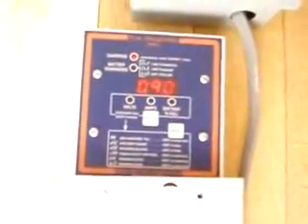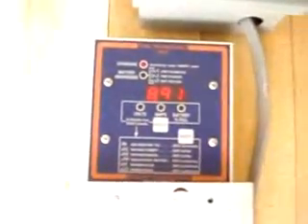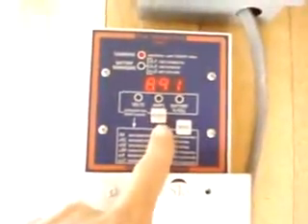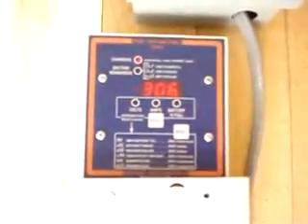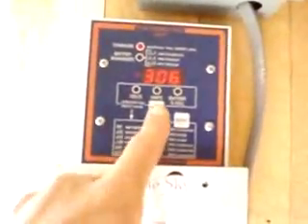This is a days-since-charged option — as you can see it's almost been a full day since she was topped off. Days since equalized — it's been about almost nine days since I had it hooked up to the grid to turbo charge it, so to speak, called equalizing. They recommend you do that once every couple months anyway. This is total amp hours that I have sucked out of those batteries — right now 306. As life goes on and you keep drawing juice, this will monitor the life of your batteries.